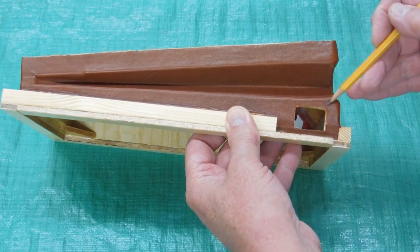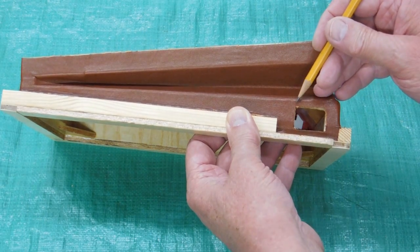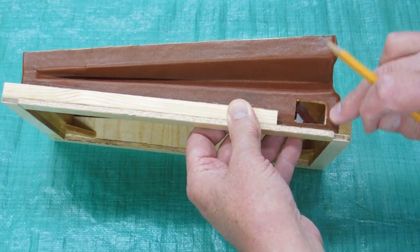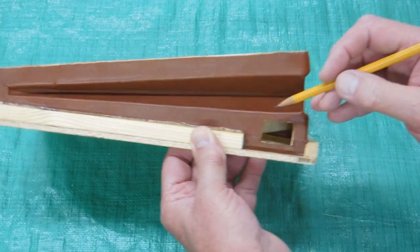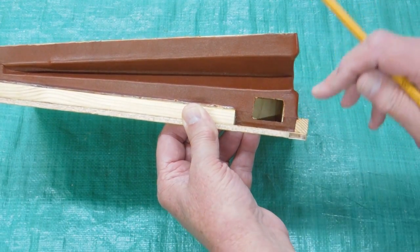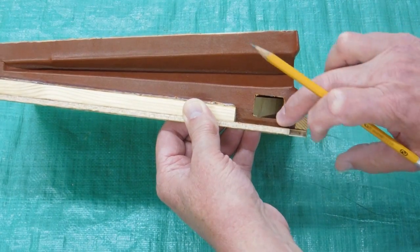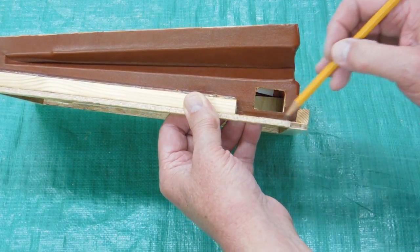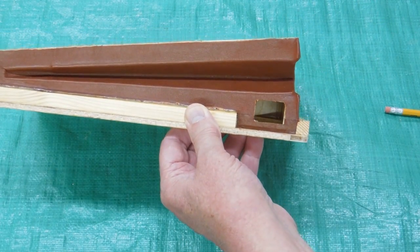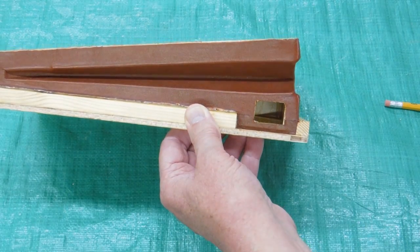Because the wood is fairly narrow right here, my only area for the leather to seal is right here. So I carried it all the way down to here. Then I took another piece of leather and glued it around to this side so that this surface is fairly flat and even — we'll call this a shim. I shimmed this to the same thickness as that, so whatever I choose for a manifold will have a much better chance of sealing against that flat surface.